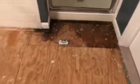All right, so our carpet is up and the padding is up, and surveying the damage. It's not too bad. We thought we might have to replace the subfloor, just this piece of wood right here. But I think we're gonna be okay, because these pieces are coming up anyway. Well, no, because we're putting down hardwood. So what we're about to do now is we've already sprayed it with 50-50 bleach and water. So now we are going to take the scrub brush and scrub it. Then we will leave it overnight with a dehumidifier to dry it, and a fan.